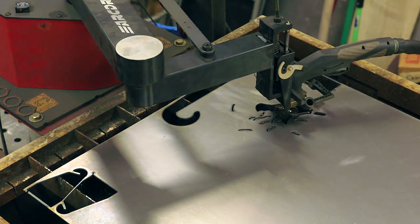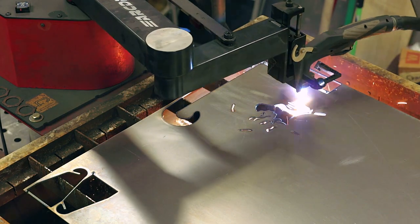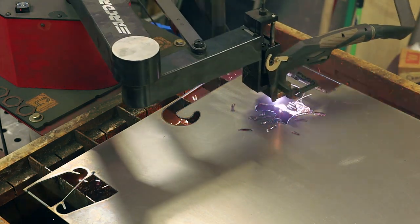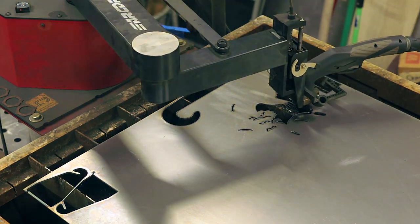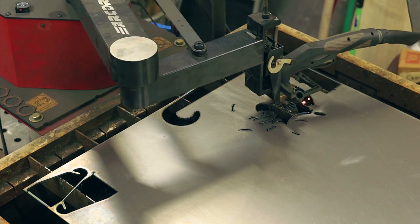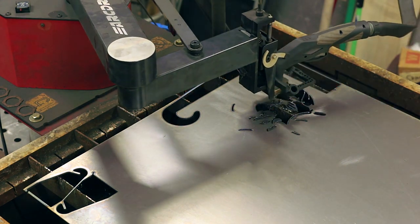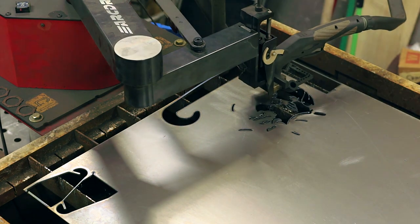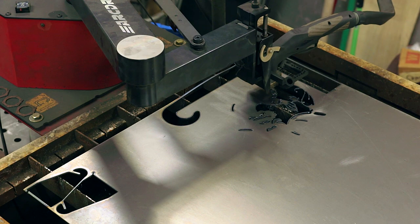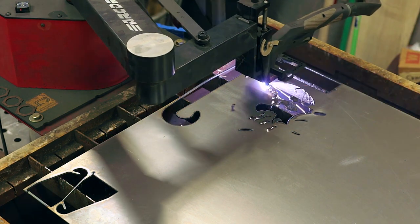With my adjustable voltage divider, I can set it right where I want, and it's been set to get somewhere around 60 to 70 on the TH value, and it has just been working consistently really well. I get perfect holes when I'm doing outlines of something that have a lot of movement in them. There's a minimal amount of dipping and diving anymore. I get really great consistent cuts with it. So I guess that's sort of the reasoning behind having it.